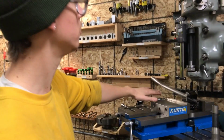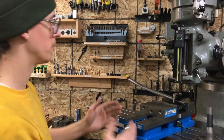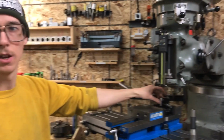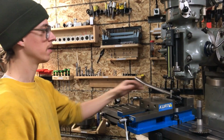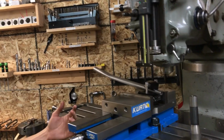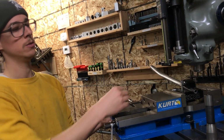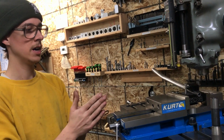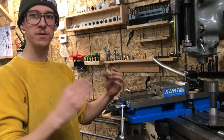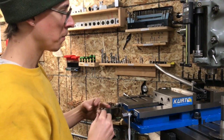I suppose you could also use this for drilling holes in certain applications, and you'd have to set it up carefully. There's sometimes you want to hold a tapered tube, and you could use this for an operation, but generally I designed it for just preparing the dropout end of a seat stay or a chain stay where you have a tapered tube, or possibly even where you had a round tube that had an ovalization to it, like if you had a titanium straight gauge tube and you maybe squished the end of it, ovalized, to fit onto a right style dropout, round dropout.